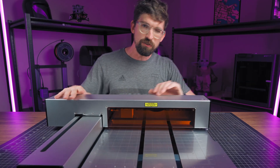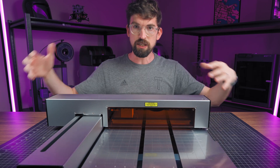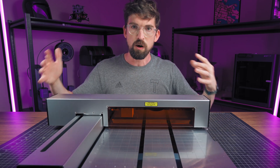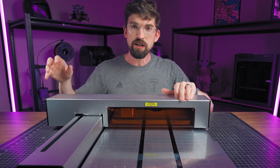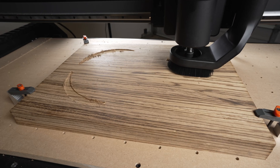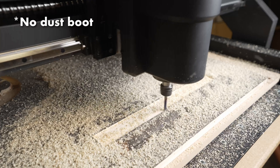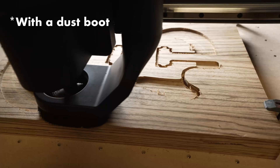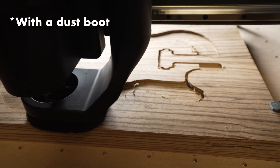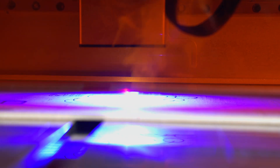With that being said, most of the stuff I've been messing around with is wood. But when you get into plastics, especially cast acrylic, that stuff is pretty stinky to use — even in fully enclosed machines you're going to be able to smell it. So if you're going to be using material that will off-gas, that's still going to happen. It would still be good to have some type of open ventilation — you could put this by a window, set a fan up, or they have an exhaust module as an accessory that you could drop into a bigger filter or run a hose out a window. This is kind of using the same design principle as a CNC router, where you have a dust boot riding along sucking up chips and dust, dropping into a filtration or vac unit. But unlike the CNC router where you have to buy the vacuum and filtration separately, all of that is built directly inside the Render itself — saving you a couple hundred to over $1,000.